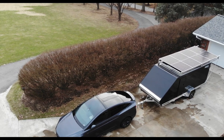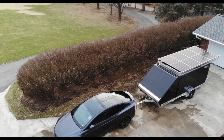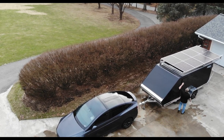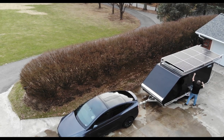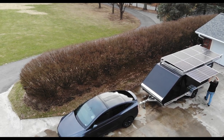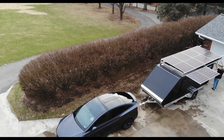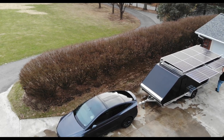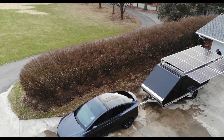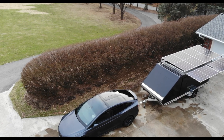I'm going to put those two panels on the front on their own string — there's a second input in the inverter. My thought is I might actually make it so I can lift the bottom up and make it more level in line with the other layers. I also have an idea how I could mount on the outside of the trailer a couple extra inputs that would add to the series of the front two panels, so if I had extra panels I throw in the trailer and set them up temporarily while parked or boondocked, I could add a couple thousand more watts of charging.